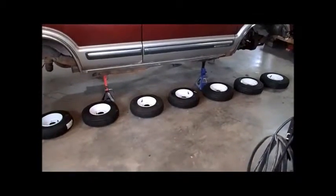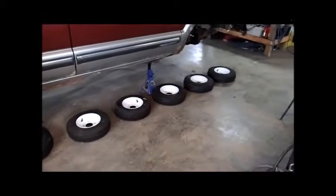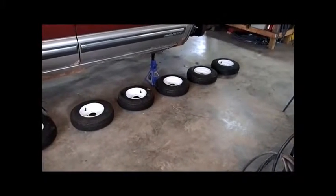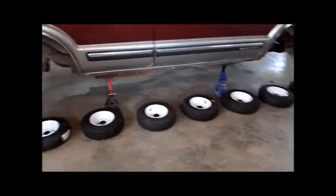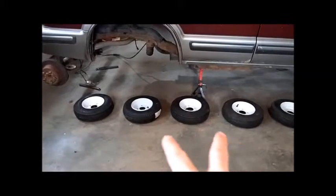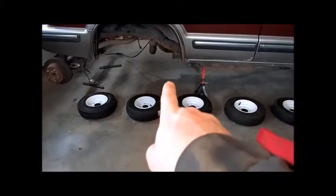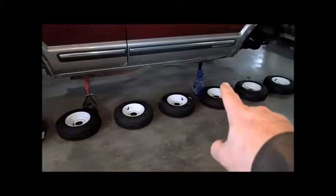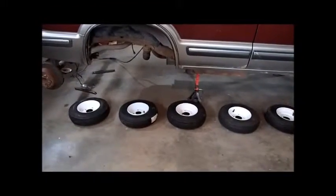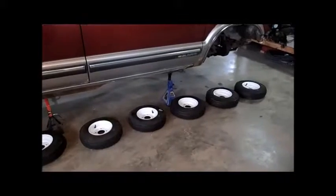We do know there's going to be a bit of an issue with the walking beams — when you go over bumps, only about two of them will be in service at a time. We thought about adding a double walking beam suspension where each walking beam was then connected to a walking beam across all four. But that would move the mount point to between the two sets, which leaves the center of gravity front-to-back a little narrower. We're a little concerned with that, so we decided for this test run we'll just mount it fixed.